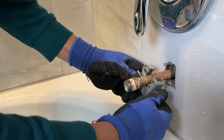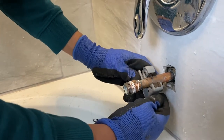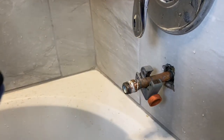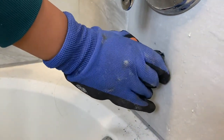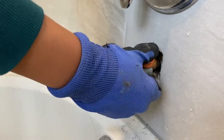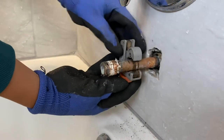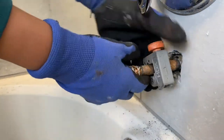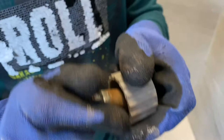When you're ready, unscrew this and put the pipe cutter at least around the middle of the pipe so that the coupling can fit. Keep turning until you feel it is stable and firm. Give it a couple of spins in any direction, then keep spinning until it cuts the pipe. Now sand the pipe to make it nice and smooth for the coupling to fit.